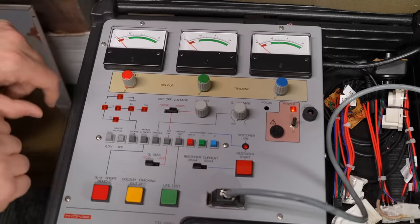If we power cycle this computer, I have an 80-column card in here connected with the auto switch module. So we type PR#3. So the 80-column card has a quite different looking video signal — we have to turn down the brightness there. Now that particular difference is not something in the monitor — it's actually on the auto switch card inside this computer that switches between 40-column and 80-column mode. There's a potentiometer on there you can adjust. The 80-column text is looking really good and syncing really well to that signal. The text is nice and sharp and looks freaking fantastic. It's also nice to know that this clone machine is working.